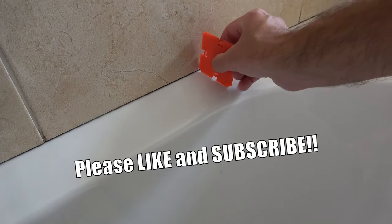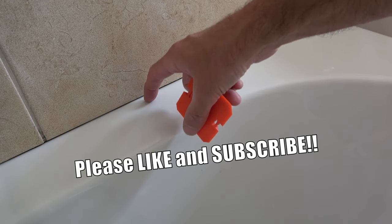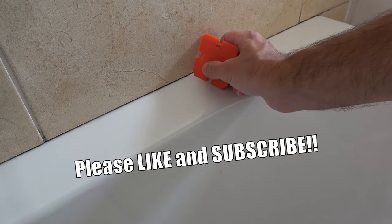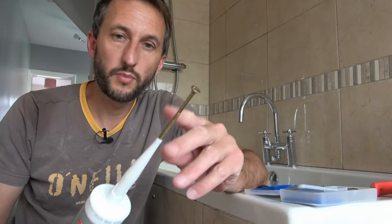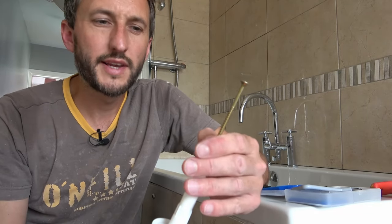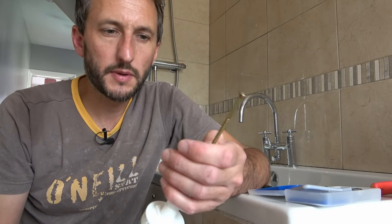You can work out which profile you need — what you're trying to do is obviously bridge the gap between the bathtub surface and the wall. If you've got a large gap you need to use the suitable profile. In my case the gap's not too big so I'm going to use the 8 millimetre, and that's plenty big enough to cover the gap without looking too big or being too small. I've already used this sealant for my basin the other day so I've put a screw in it to stop it going off. I'm going to make the hole slightly larger because you want your hole to be a little bit bigger than the profile you're using — if you're using an 8 mil profile, ideally you want something 9 or 10 mil wide.